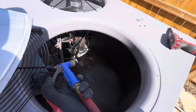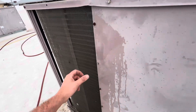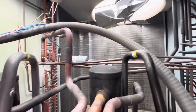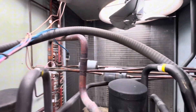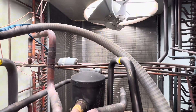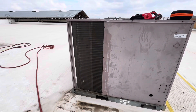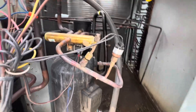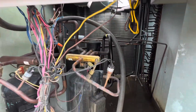One note: you also want to go against the airflow. This coil is very thin — only two rows — so we're pushing it all the way through. It's very easy to get through. But when I am spraying the coil cleaner I'm going to go this way, against the flow. If we had a four or five row coil I would definitely go the other way. Now here we are going into step number three: coil cleaning.